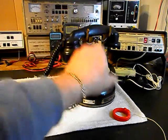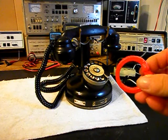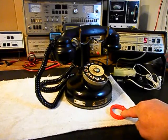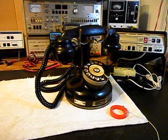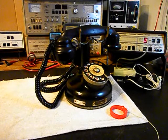Now, we want to go ahead and get a start on that, but we want to mention our amplified pickup. We use this in troubleshooting, repairing, and on our final checkouts. It's amplified so that you can hear the audio from a receiver. I have an amplifier back by the video. It has a button on it, and I can push that button and give dial tone or take it away at any time. And since it's an open amplifier, it's prone to any kind of static interference or noise in the atmosphere, so when you press the button, it will have a slight hum to it. I'm going to go ahead and press the button. You may be able to pick that up in the video.